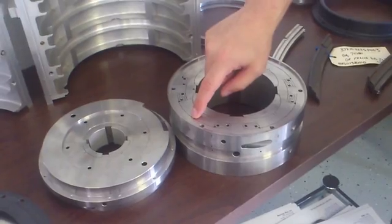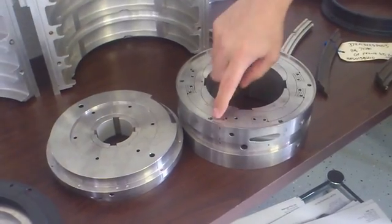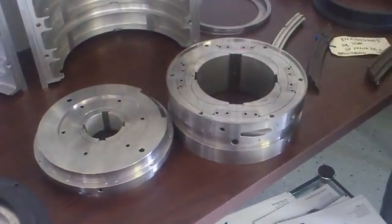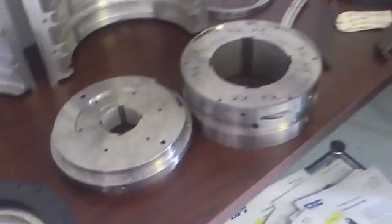This is your K — stiffness. This is your C — damping. The damping is controlled by the clearance of the orifice that feeds the damper land, and also the end seal clearance, because that controls how much resistance the oil has as it tries to escape. The more resistance it has, the more damping and dissipation it's going to have.